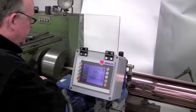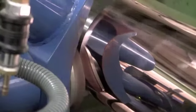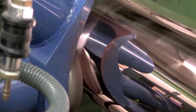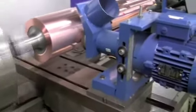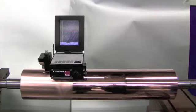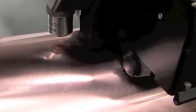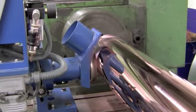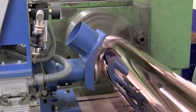These movements and forces can be adjusted to achieve the desired surface properties, especially to create different roughness and orientations of the brush marks. The process has been tested in the field through many test cycles. We have compared the different surfaces using a Hommel tester and microscopic inspection. Many brushed cylinders are now used in standard printing and embossing processes, with more applications yet to be tested and evaluated.